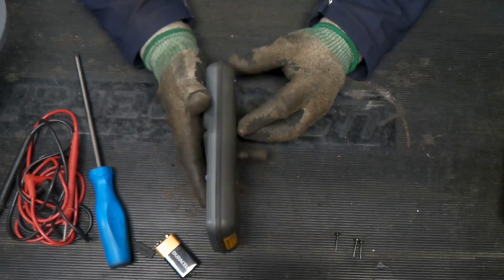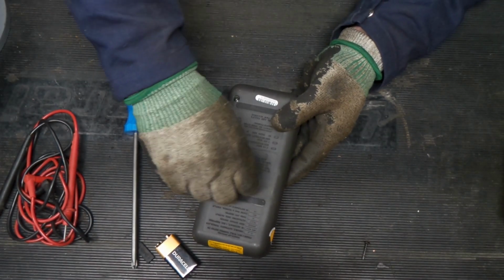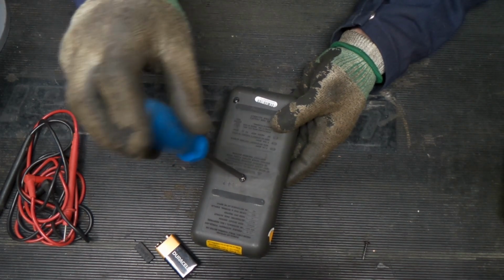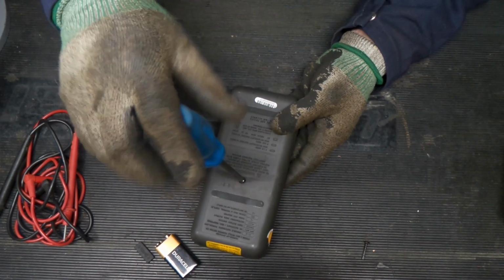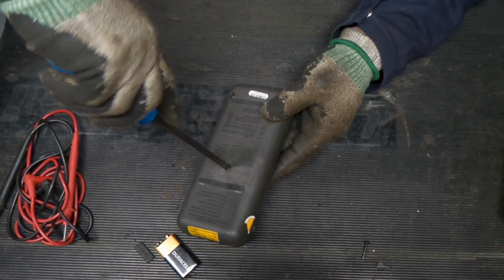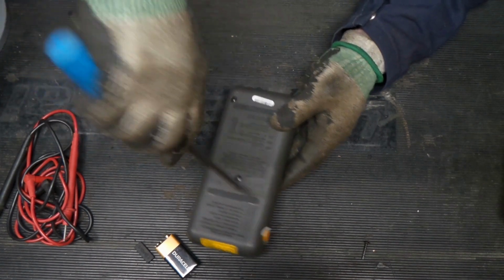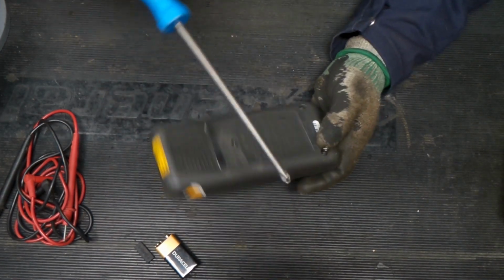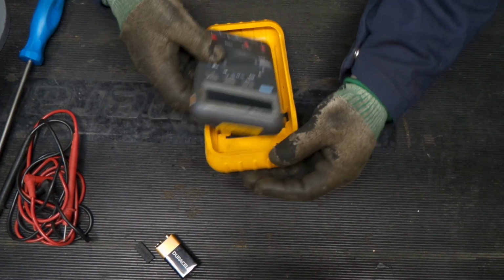It does feel like it clips together a little bit. Now you've heard me say a bunch of times, anytime you start a screw in plastic, go backwards with it until you hear it pop like that, and then you know you're in the old threads. That's always very good, because if you cut new threads every time you run a screw into plastic, you run the risk of stripping out your tool's screws. So now we'll enter in our case again.